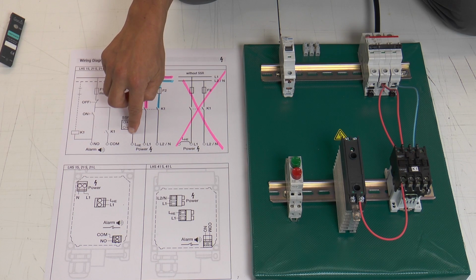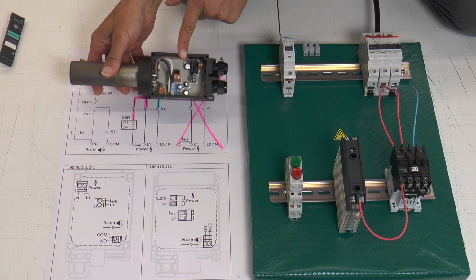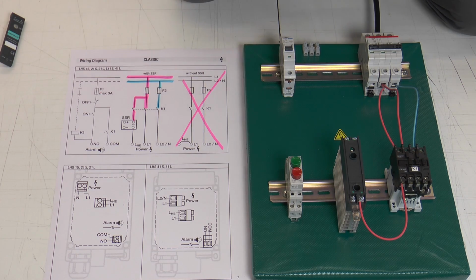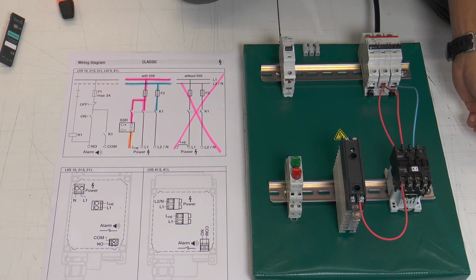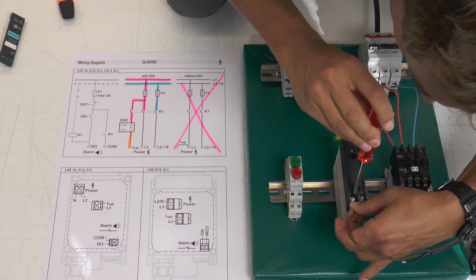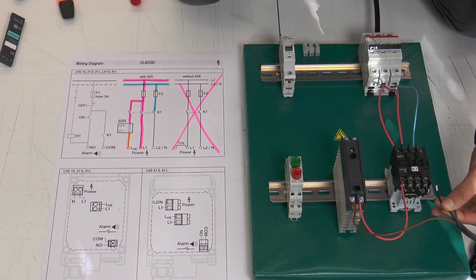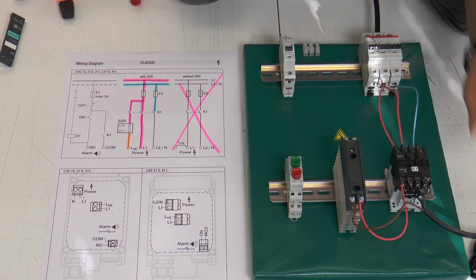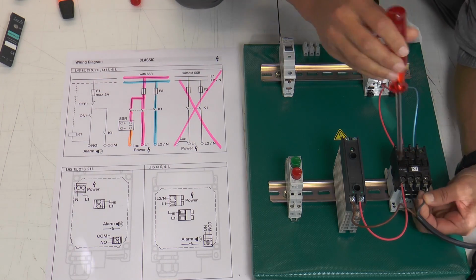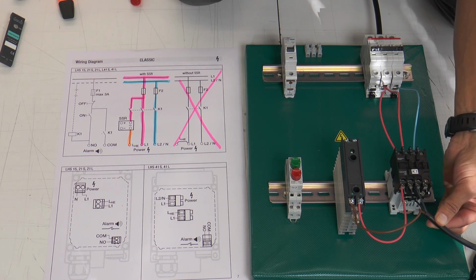Now we have to connect the LHE line, the L1 line and the L2 line or the neutral line with the LHS Classic. For this you need a wire with 3 single wires. From the SSR we take the LHE line which goes to the heating element of the LHS Classic. The L1 line has continuous power and the L2 or neutral also has continuous power. We need these two wires to feed the basic electronic of the LHS Classic.